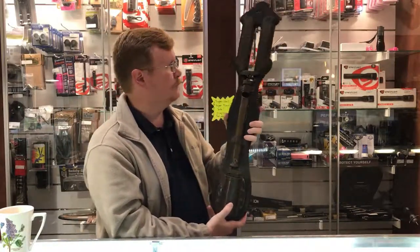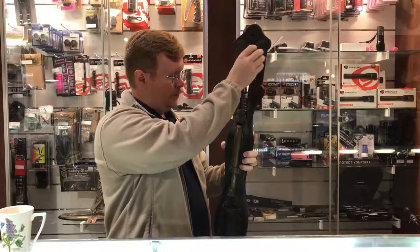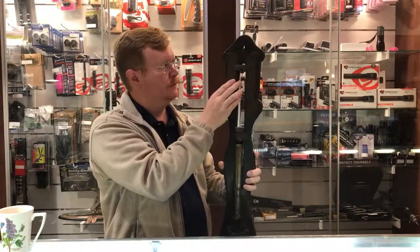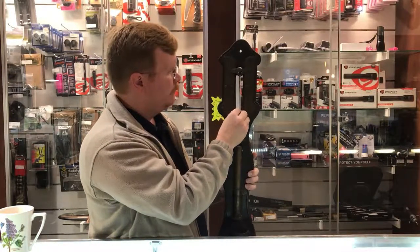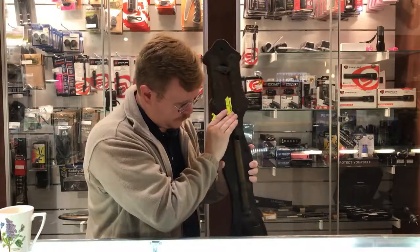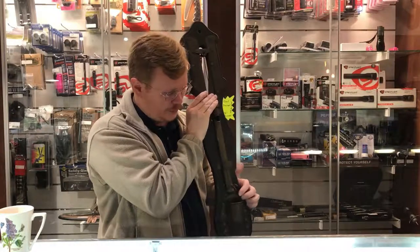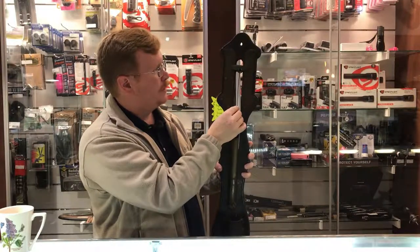It's definitely a very interesting clock. What you do is fill it up with water. When you fill this section here up with water, it has a cork that will rise and raise this piece, which will then mark the hours of the day. You'll calibrate it at the beginning of the day, and then it has a spigot — you'll adjust the spigot to drain or drip the water out at a rate that corresponds to one hour.